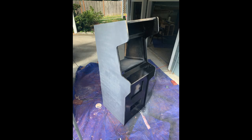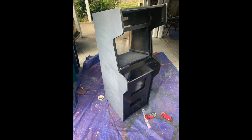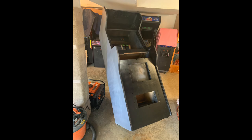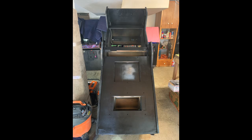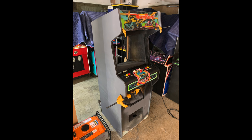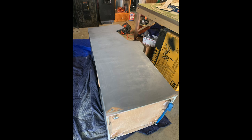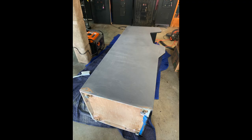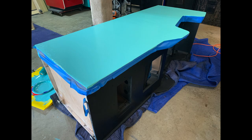Here I've started painting the inlet, and what you may find sometimes as you get into this and start even to the point of painting — even with primers going down — is you still find there are some flaws in the cabinet. You may have to go back and re-bondo and re-fill. Don't get frustrated. Don't think of this as a roadblock; think of this as the work itself. It's an extremely important part, because the more you prep your cabinet before you're ready to actually do painting, the better you are.